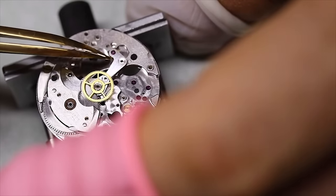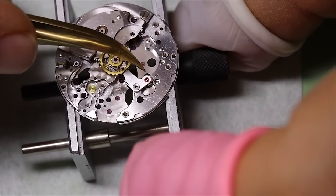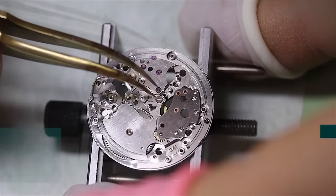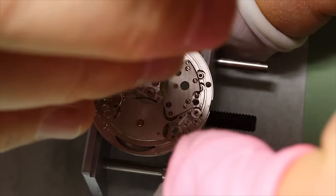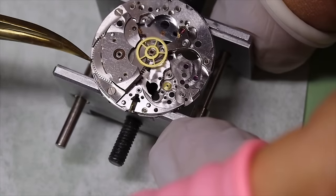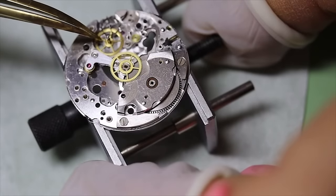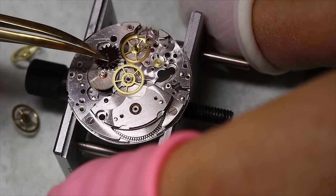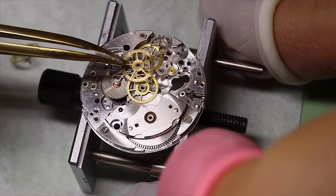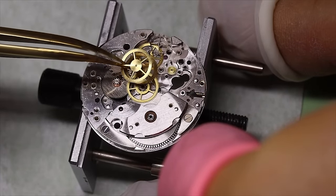The center wheel is also a bit odd — there is also this little wheel that goes underneath it for the automatic works. The thing is that we have to screw it in from underneath. But if we put too much pressure, especially on the screw close to the center wheel, then we are going to push the whole wheel out, so we have to be careful. And of course we always want to double check that the wheels run freely. Then we can start putting the rest of the train in. It is quite funny as well that the escape wheel is all the way at the edge of the plate.